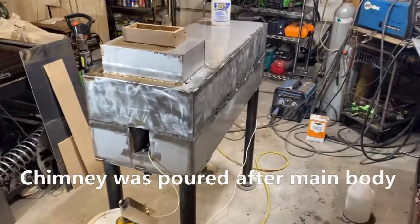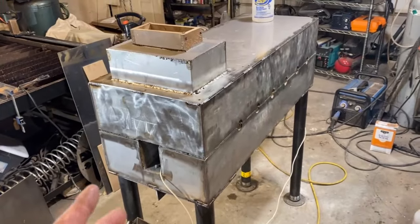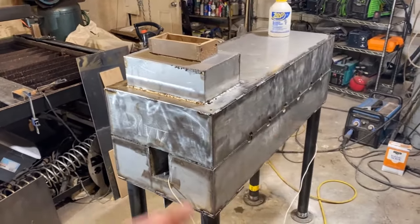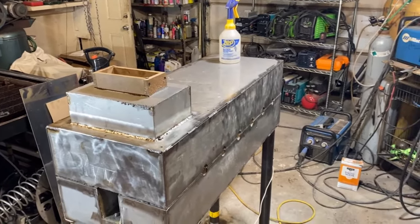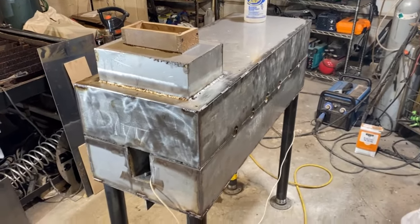This is where we are in the curing process. I did an initial dry-out with electric heat because it's convenient and easy. I brought it up to 212 degrees and held it there for a while, slowly brought it up to the boiling point of water, let it hold there until it started making some noise, and then brought it up to about 344 degrees with the electric heat.